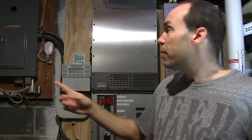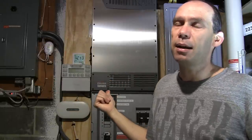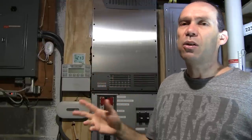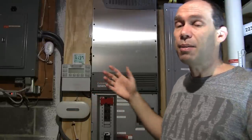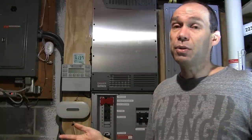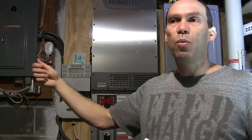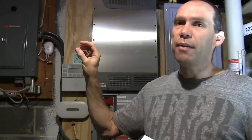Does the order really matter? Perhaps there are one or two quick breakers you could throw to get things down. But if you take a system down without following the correct procedure, the minimal worst-case scenario is that bringing it back up correctly might take longer and you may damage something in the process. In industrial environments particularly, if you de-energize electrical systems in the wrong order, you could have equipment running with its cooling or safety support systems shut down — causing overheating, damage, or even an explosion. It can be very critical to understand shutdown procedures.